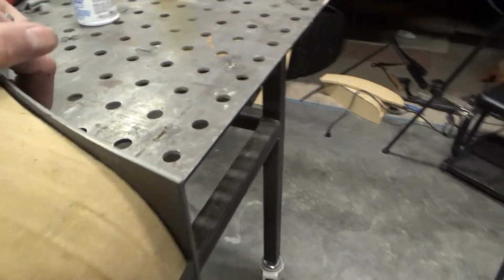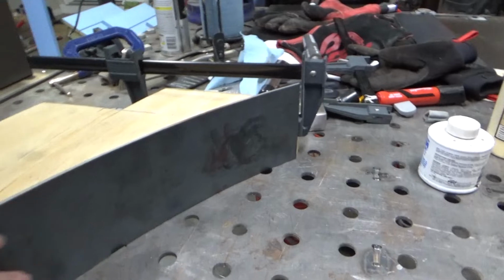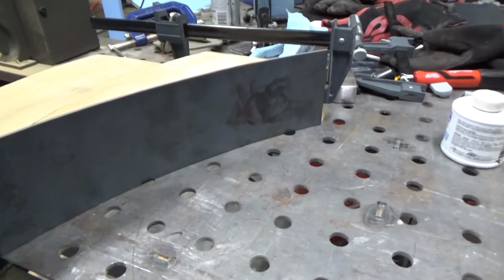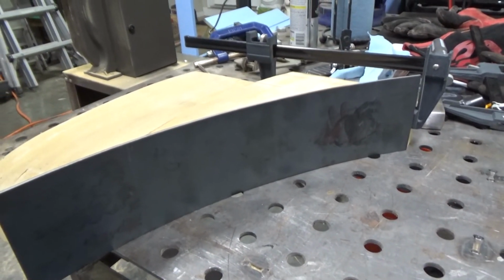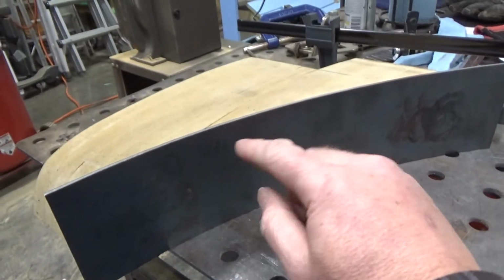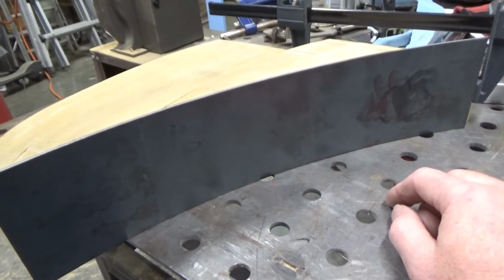Once I cut this piece of steel along here to that profile, I will set the other pieces of steel in here. I'll have to bend them to the right curve, and then I'll get a little scribe and mark them down, whatever that 1/8 of an inch dimension happens to be. I'll measure that really carefully once I'm there, and then I'll build that out 0.35 inches, and then we'll trim all those out so they'll match that same curve but be 0.1 inches lower. And that, I think, is what we're going to use as the hammer form.